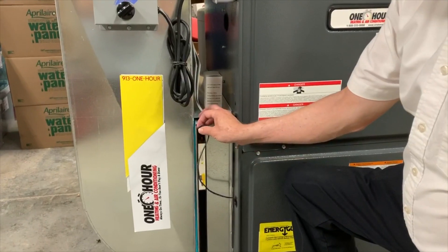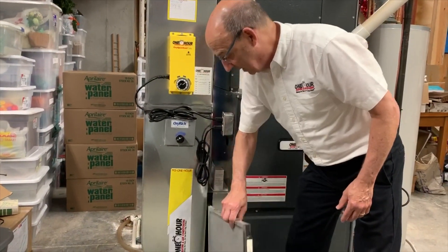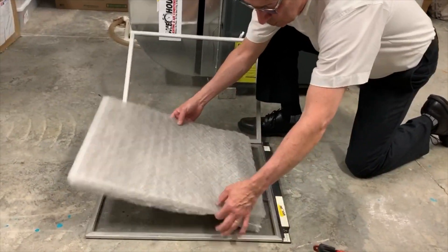Cost-wise, the thought might be that this is a much more expensive way to filter the air in your home. It's about a hundred bucks and you get three or four of them. But actually, the expense of the medias is very comparable to that of a good air filter. And understand, this is not a filter — this is an air cleaner, and those are very distinguishable. You have to be able to capture very small particles to be in the class of being an air cleaner. It takes the place of the filter, and these medias are very competitive with a good media filter, but just much, much more efficient.